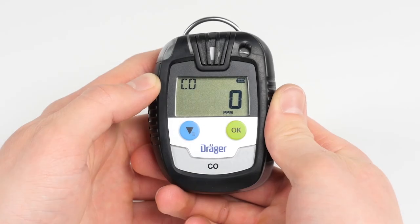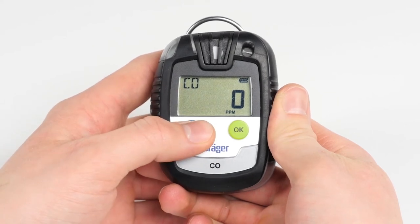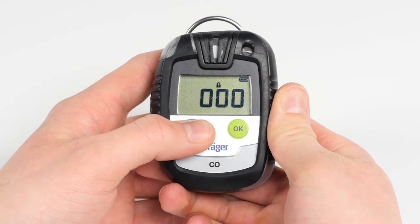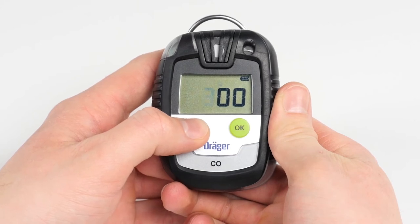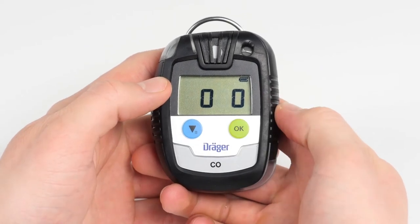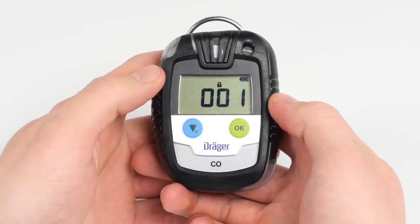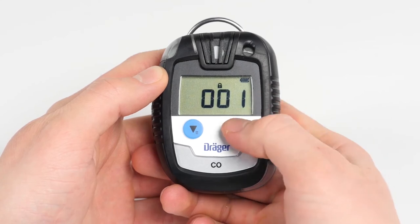In order to make a fresh air adjustment or sensitivity calibration, go to the password menu. Press the blue menu button and hold for 5 seconds while the device is in measurement mode. In the password menu, you can change the flashing digit from 0 to 9 using the menu button. By pressing the OK button, you can accept the value and proceed to the next digit. After the last value has been accepted, the three digits will start to blink.